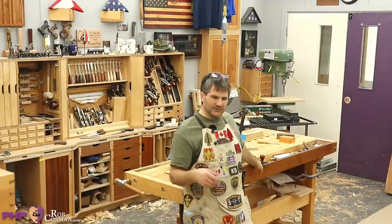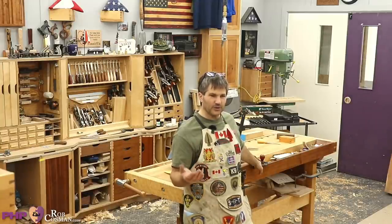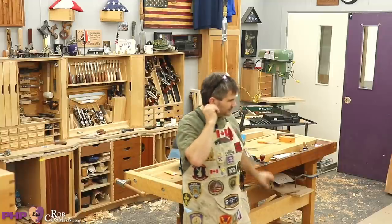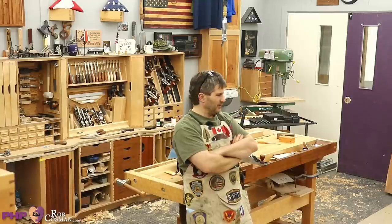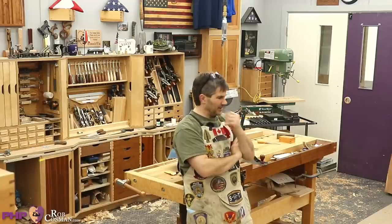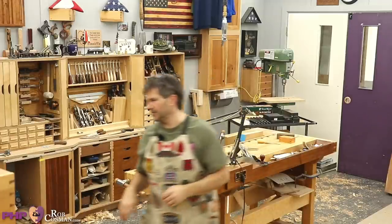And it cuts relatively slowly. And it, as I mentioned, generates a lot of heat. So you're constantly worrying about burning or drawing the temper out of your cutting edge because of the heat. Well, CBN wheel, I don't know how long they've been available, but we actually had our own manufactured, had some changes made. A CBN wheel is a solid steel wheel. It's heavy. I got one right here.